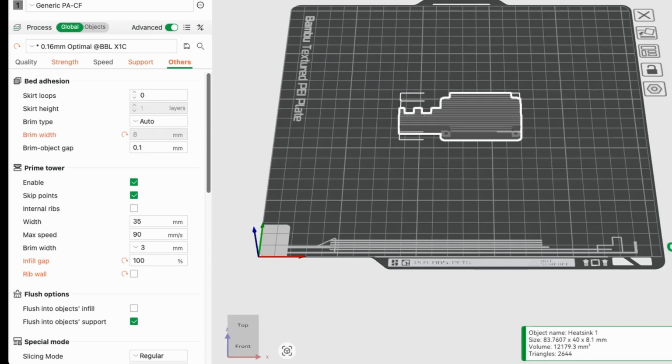I saw that drying it out at about 70 degrees centigrade for maybe a couple of hours was the advised drying method. Does that sound right? Yes. The only little caution I'd say is, depending on what you're using to dry it out, try to keep it away from the heating element, or maybe put a foil or something as a barrier if it has to be close. We have had the spool on a couple of them get warped.